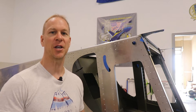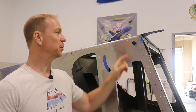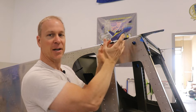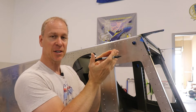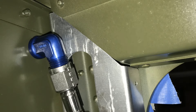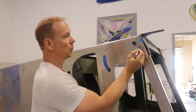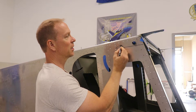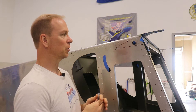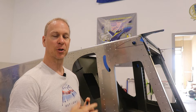For the installation on the passenger side of the airplane, we're going to start up here at the top and work our way forward towards the fuel selector valve. The first thing we want to do is position our elbow fitting here. You want this to be as high as possible so that it fits inside the wing, but not too high to where it's cutting into the longeron, which you can see from the inside of the airplane. You don't want to cut into that. The bottom of the wing is going to come somewhere kind of like this, and depending on exactly how you position your wing and exactly where you drill this, it may stick out a little bit below the wing. In fact, that's how it is on my cruiser.